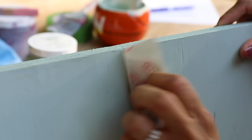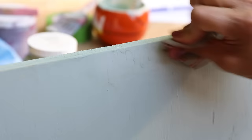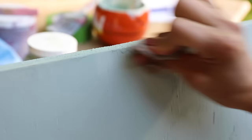If you didn't catch runs before they dried, you can sand them out. Use 150 grit sandpaper to smooth out the drips so you can paint over them and have it look like it never happened. Be careful not to sand too aggressively, as you can sand down to your project and create spots that won't cover. Once it's smooth and you no longer feel those ridges, take your paintbrush and go right over it again — it should blend right in.